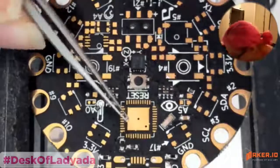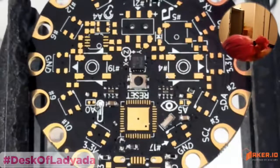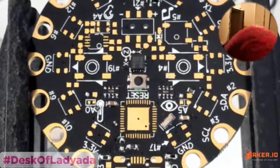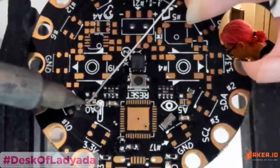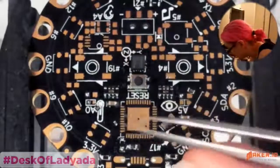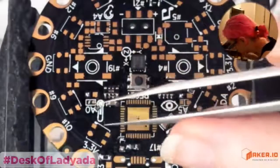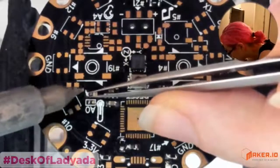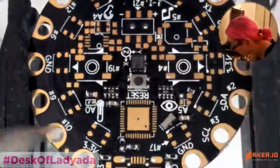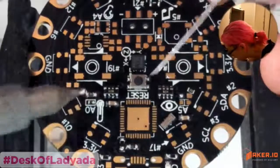See, this is how small an 0402 is. I mean, that's ridiculous. It fell and I didn't even notice it. I was like, hey, I don't have any thermistors, and I actually did, but they're so teeny. They look like dust. And these are not even the smallest components you can get. You can get much, much smaller components. So 0201s, 01005s, I mean, they're nearly impossible to see. I would have preferred not to use 0402 thermistors, but it actually was cheaper than 0603 by a cent or two. And I was like, well, whatever, I might as well go for it, because once you're manufacturing, it doesn't even really matter. Also, DigiKey seemed to have more of the 0402 ones in stock, which made me think this is a more standard size.